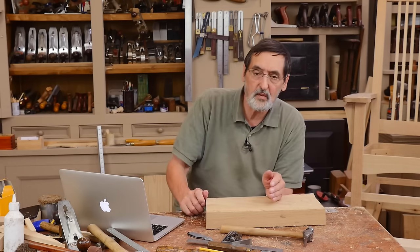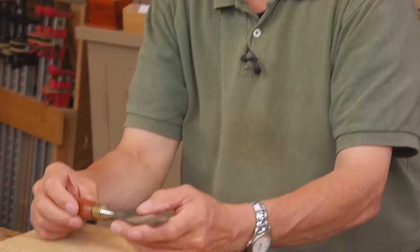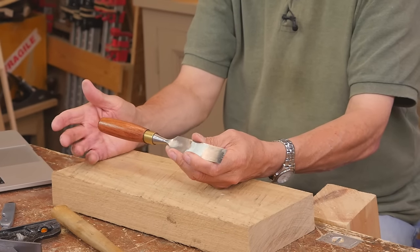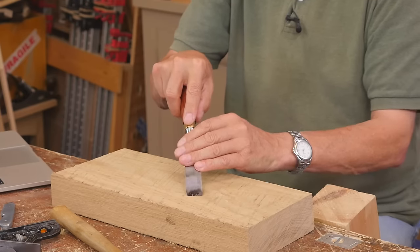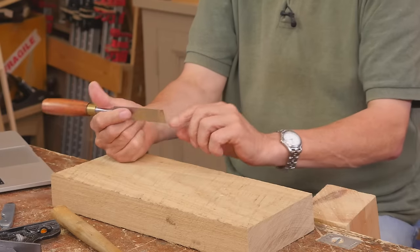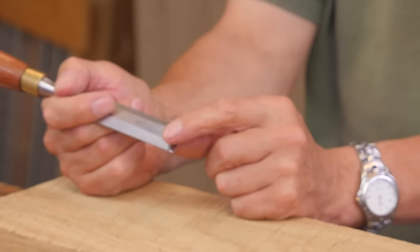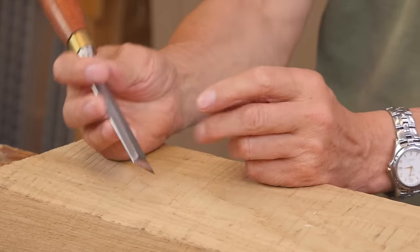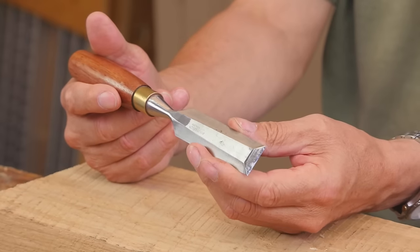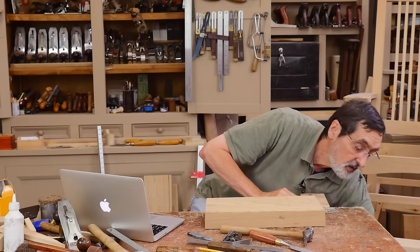If you're only doing the bevel — once you've initialized the flat face of your chisels, which is usually done on a dead flat surface like granite or glass, you only have to do that once. When honing the bevel it doesn't matter if it has a hollow, it's actually beneficial. You can see I use a convex on the bevel — I like that, it works well. You can work through all the grits to 1200. You don't actually need to strop and polish out the bevel, but it takes so little time you may as well — I do it on my strop.